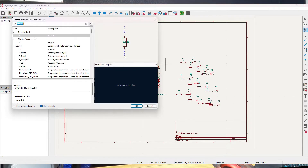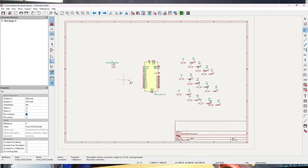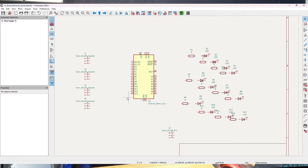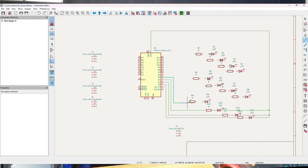Then I'll add 12 resistors and identify them as 220-ohm. For my servo and capacitive touch sensors, I want pins and sockets — I want ports ready to go to connect my components to them. I'm going to be installing this in a larger box where the capacitive touch sensors and servo will be physically spaced away from the PCB. So I just want pins and sockets to easily land my stuff on, and I search for generic connectors.